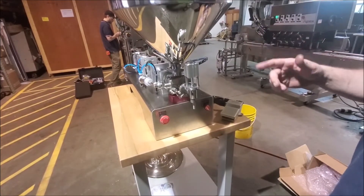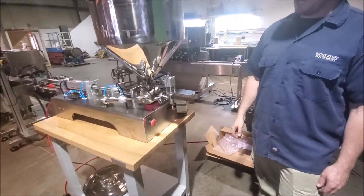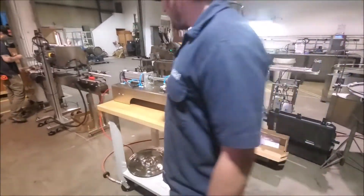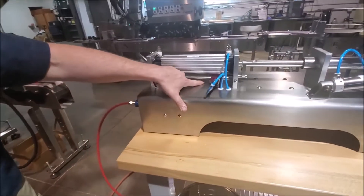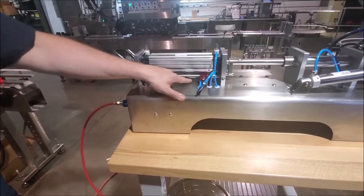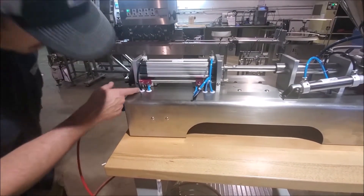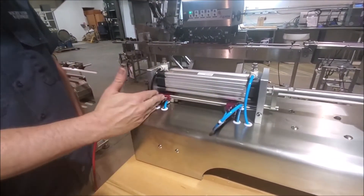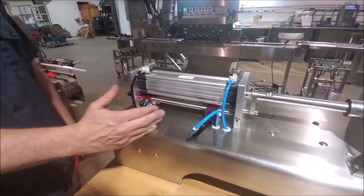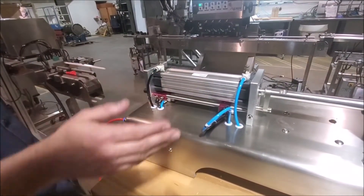On the back end there are a couple of limit switches. As soon as it hits those limit switches, it's just going to continue to go. There's one on the front side — which is your forward stroke — as soon as we hit this limit switch, it's going to change and start moving backwards. There's also one on the back. Same concept: as soon as it hits the back one, it'll start to move forward in automatic mode. So in automatic mode, this thing's just going to cycle continually — you'll have to put jars underneath.